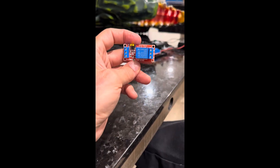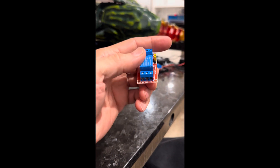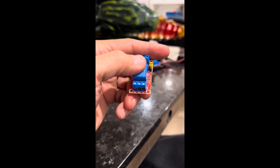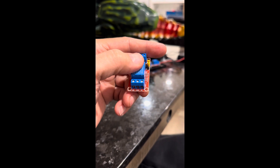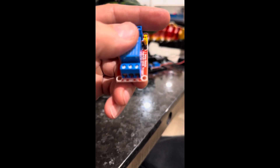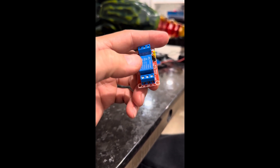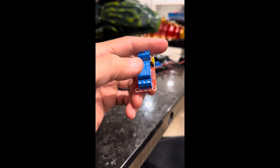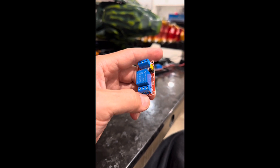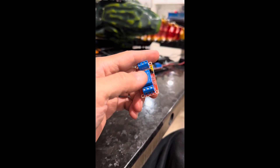So here is a breakdown of the 5-volt relay. On this side you have the switch part — the trigger. You see here it has NO, which stands for normally open; you have COM for common; and then NC for normally closed. Most switches are going to be normally open, meaning when you push the switch or the try-me button, you're closing it. I use normally open for both the try-me port and my fog machine, and they work great.